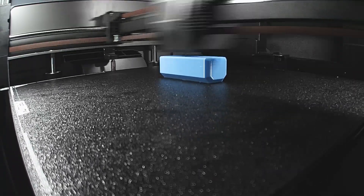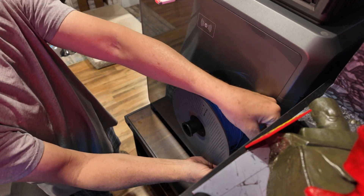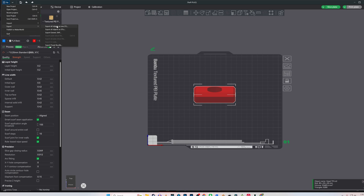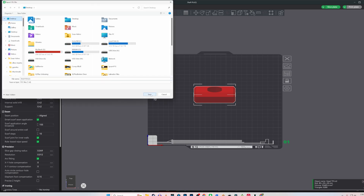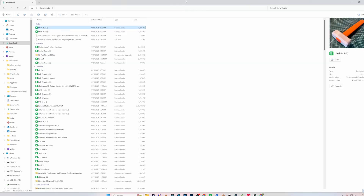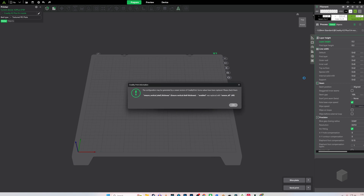The K2 Plus did not print as well. We couldn't use the TPU for AMS in the CFS, so we had to put the roll on the outer spool. There are a lot of imperfections in the print — dots all over the surface. We dried it at 70 degrees Celsius for eight hours and printed again, but it didn't really make a difference in quality, though it is a sturdy print. One thing to mention: we pulled the test print from Maker World and exported it from the Bambu Lab software, then imported the STL into the Creality Slicer. We didn't check the settings, which led to a lighter infill on the first print and the mallet broke right in half. We fixed this by dragging the 3MF file into the Creality Slicer, which pulled in all the same settings and gave us a solid print.